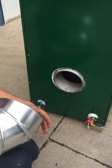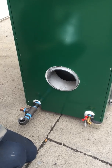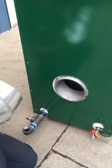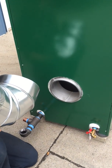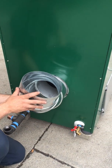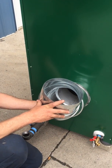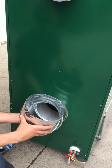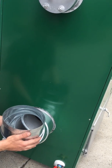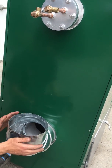Now we're going to go to the flue opening — this is where the combustion gases come out of the boiler and start to go over to the chimney. This is an 8-inch on the K6; your flue opening is 8 inch. Keep in mind everybody's flue is different, everybody's install is different. You install this to what your installation requires. Here we're just doing a quick simple mock-up to demonstrate how we do it here at Keystoker.